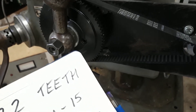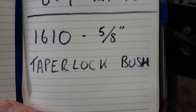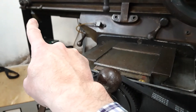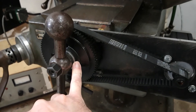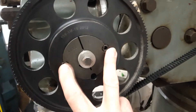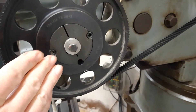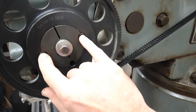In the centre of that is a boss — a special boss called a taper lock bush. For a 5/8 inch shaft, which is the shaft that comes out of the Bridgeport — this particular Bridgeport, the BRJ — it's 5/8 there and 5/8 on the cross slide as well. That taper lock bush locks onto a plain 5/8 of an inch shaft. There are two grub screws, one there and one there. You can see it more easily on the larger pulley for the Z axis — it's got a split and it's tapered so it goes in along the length of the shaft. The pulley itself has a matching taper, so when you tighten the two together, it squishes the bush onto the shaft.